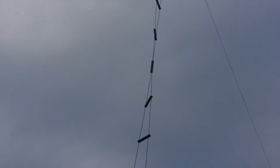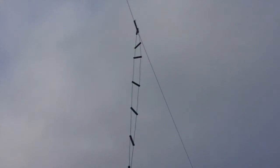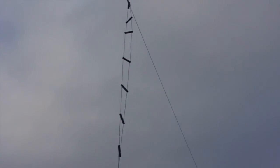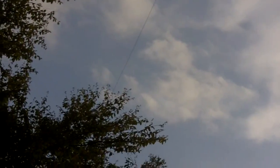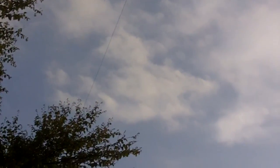This is a quick example of what I use to try to get my 160-meter doublet to tune. As you can see, I've got two ends — one end works its way out that way, and another one heads up that way. Mine is 240 feet end-to-end. There's the feed line up there.